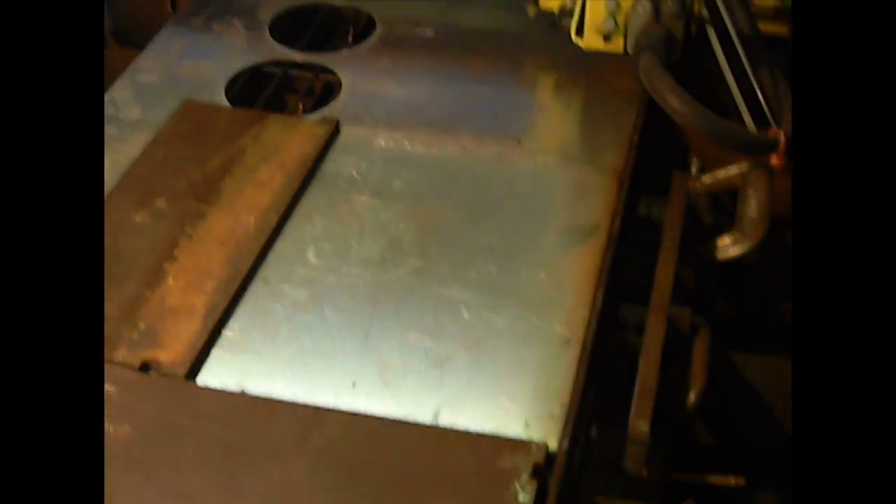There's my box of parts. It took me about 45 minutes to set up the machine and get everything working. It took a little while to figure out that my cutting problem was caused by grounding issues from using a painted work surface — here I am, supposed to be welder guy, and forgot that a ground is important even for plasma cutting. But after a couple of test cuts, trial and error, getting everything squared — about 45 minutes altogether — and then it took me about 15 minutes to cut the pieces.